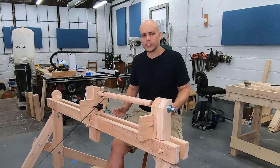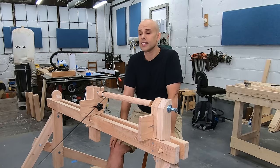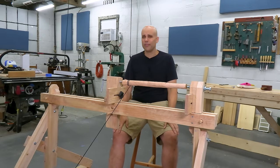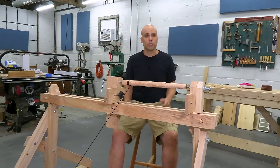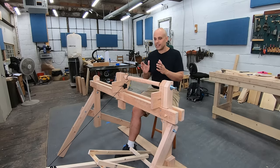A lot of people are going to ask: why didn't you build a treadle lathe with a flywheel? Didn't you want that continuous motion, not this back-and-forth nonsense? And the answer is no, not really. I have used a bunch of those at museums and reenactment shops, and I've never been very impressed with them. And some people who run those old wood shops have told me privately that those treadle lathes don't work very well. Spring pole lathes, surprisingly, work better. Treadle lathes are also much more difficult to build; spring pole lathes are much simpler. That back-and-forth reciprocal motion seems like a problem, but it's not — you get used to it very quickly. And this pedal, attached directly to the workpiece, is like direct drive. When you push down, you put a lot of force right into the part that you're turning. It's surprisingly powerful.